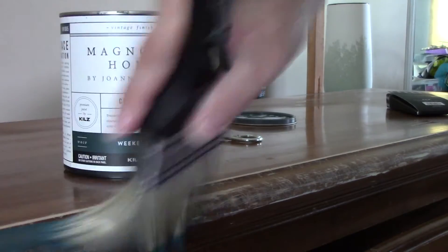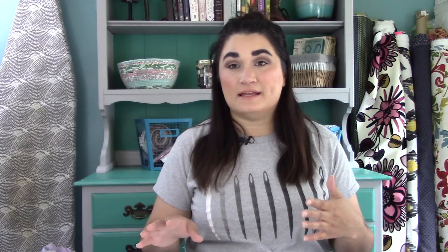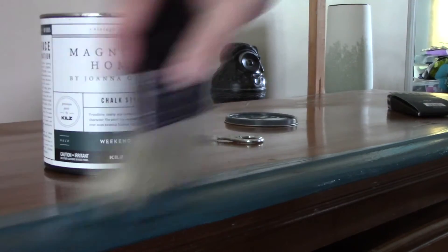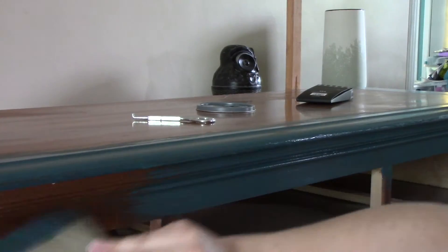They have a lot of colors to choose from, so you don't have to go as dark as I did, but I wanted something darker that would really stand out against those light gray walls. For this piece, I wanted to try giving a roller a try to see if I could get a smoother finish. When I started painting, I just did long smooth strokes on the edges that a roller wouldn't go over as well — anything that was curvy or bumpy I did that first with the brush. Any molding details — these older pieces of furniture tend to have a lot of that — I went over that with the brush first and the paint really did go a long way.